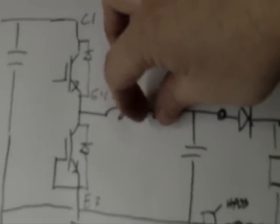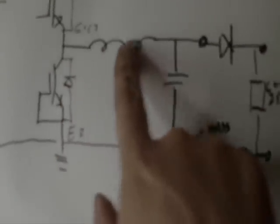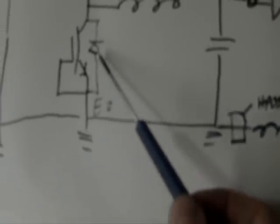It's a bit like a spring, insofar as when I turn on the power here, I'm going to tension that spring. If you can kind of picture the coils here, when the power comes on, the coils are going to squeeze. I'm going to squeeze them in, and then when I turn off here, they're going to twang back out and keep a current flow going, and the current is going to flow this way through that body diode and back up, and it's got a pathway to flow. As we can see in our theory circuit here, current will flow this way through that diode SW2, and then when I switch back on the high side, the diode turns off and I start the whole cycle over again.